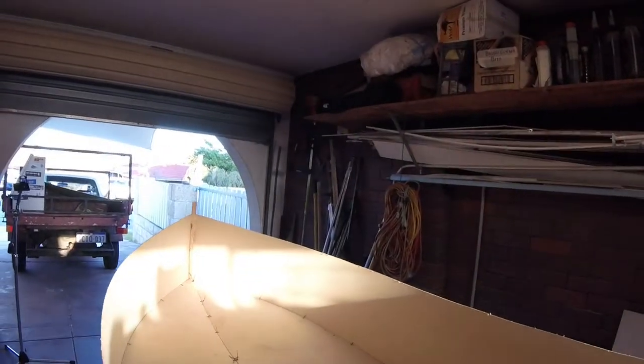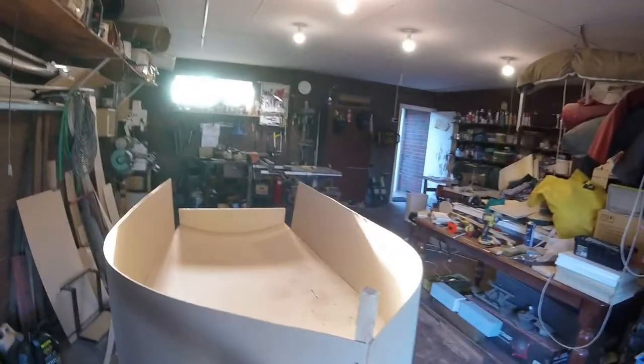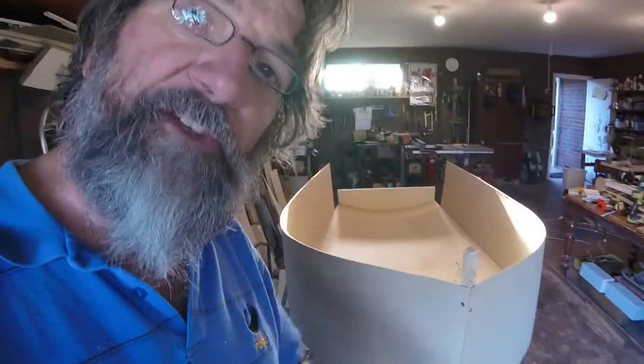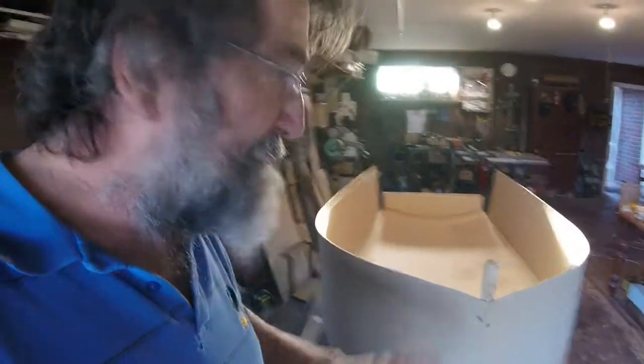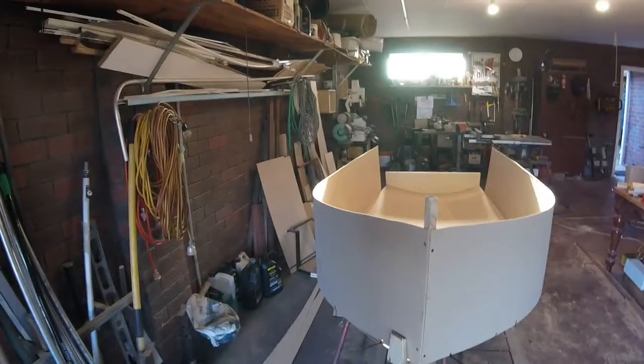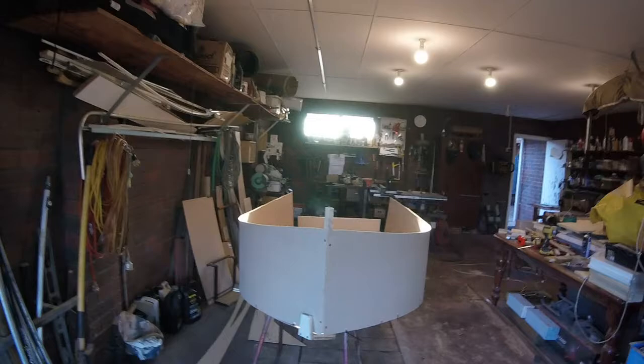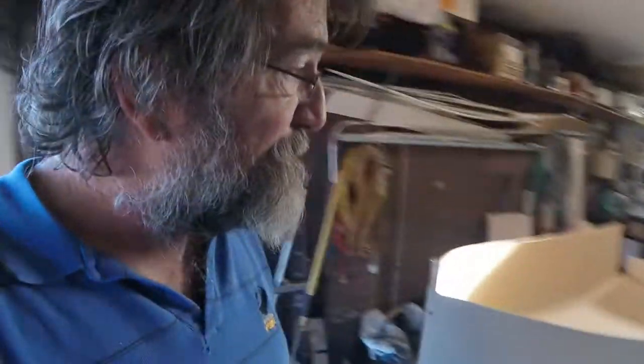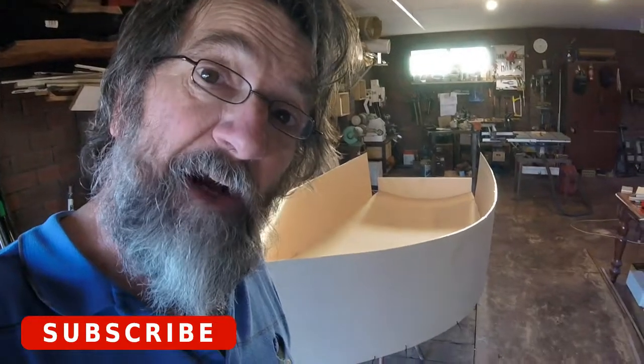When the seat goes in, the sides will splay slightly. The stem post — I've just put this in temporarily — I'm thinking of spreading it a little bit and filling the gap with thickened epoxy. All of this is going to be covered with 200 gram glass and epoxy, so it will be painted quite nicely I hope, and that will add a little bit of flair to the front. At the moment it looks like one of those Great Lakes freighters. Anyway, I'm pretty happy — given I didn't really have a plan and this is all done by eye. We'll see what happens next — maybe this is false optimism.